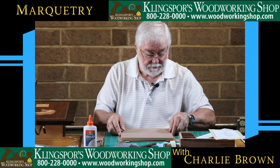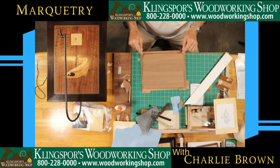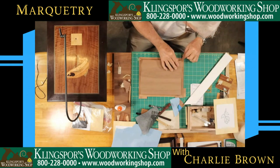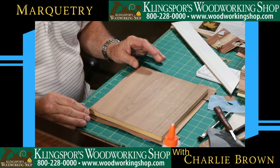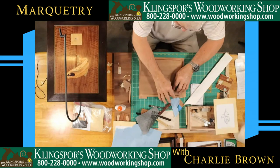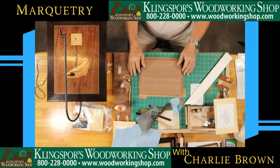You line this up and you check it to make sure that the corners of this MDF match where the corners come out on your 45 miters. So that's very important. So you've got that. Make any modifications in your line that you need to, and you're ready to glue this thing on there then.